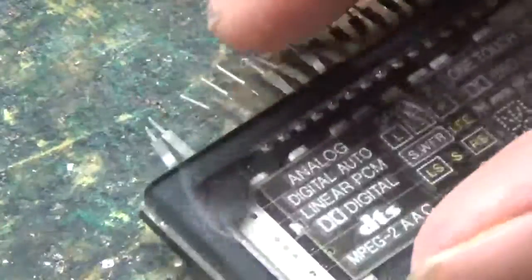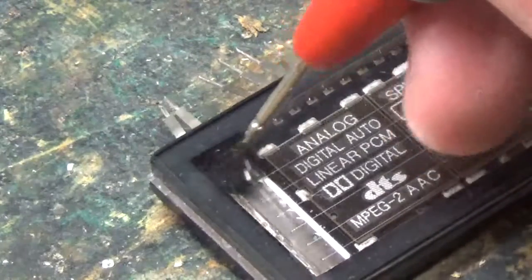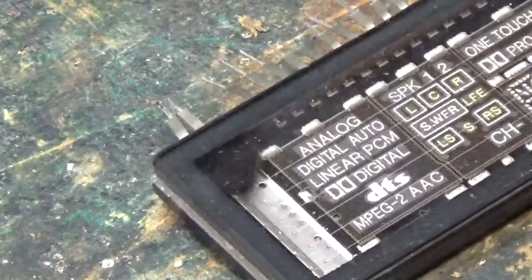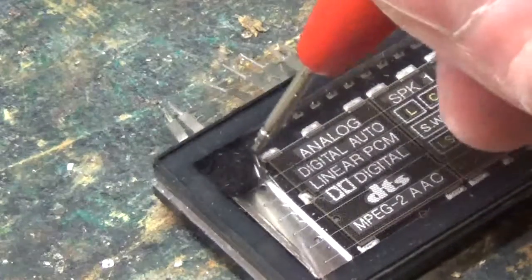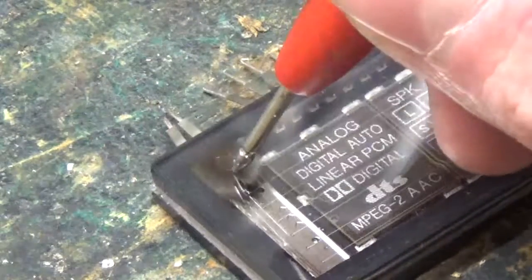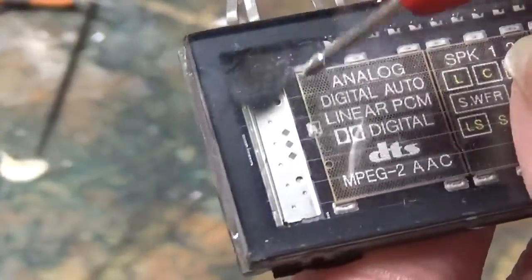There's a type of material, I'm not sure exactly what it's called, on a little silver ring in here. And what they do is after they've sealed this unit up and it's under vacuum pressure, they put a high frequency coil over it, which then heats up the getter, which then releases that chemical, creating this black splotch. And that's what that would be right there.